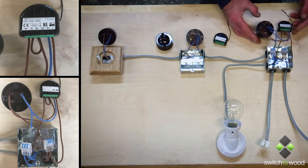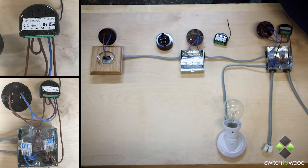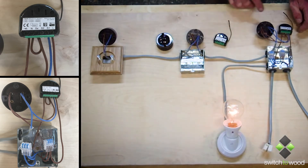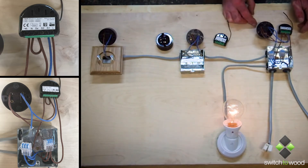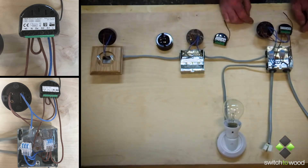So what we're doing now is we'll plug in and put some mains on this. When you first power up, it takes a little while for things to happen. This unit talks to the lamps, senses what type of load's on there, and adjusts itself accordingly. It may flash once — in this case it's doing it three times, depending on the type of load. There we go, coming up to full load, and then it will switch itself off in a minute. That's set.